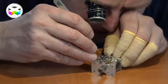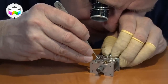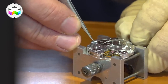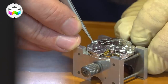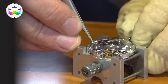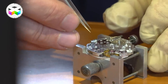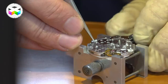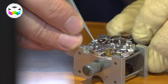This is a spring which pushes against that cam to make sure that every time it is pushed and activated, it will sit in one specific position. The click for the ratchet wheel is just a single bit of wire — you move that to one side and then you can release the ratchet wheel and let the power down. One direction it winds up; the other direction it winds down. Not the most elegant system in the world, but efficient, it works. For the most part, as the watch is actually running, it doesn't do much because the tension is taken by the automatic mechanism — it is mostly used when the watch is being assembled or dismantled.